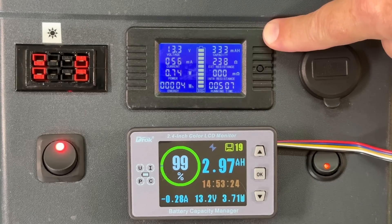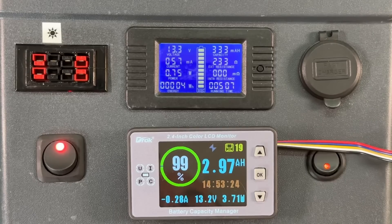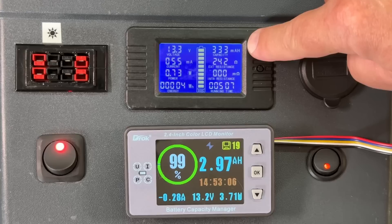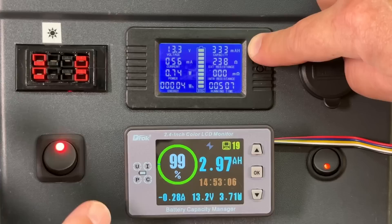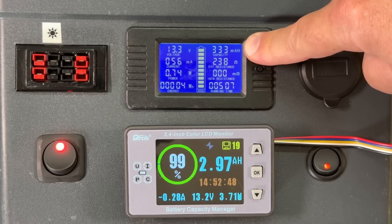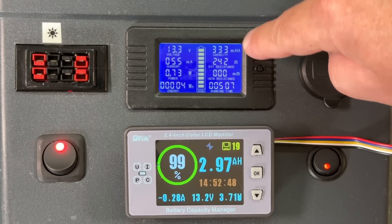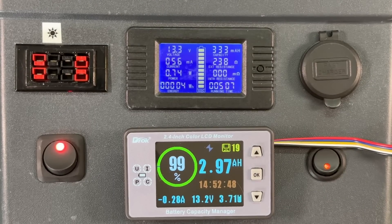For the longest time I've been using these meters to monitor what my battery is doing and they do a really good job, but this one does it better. These guys only count up, so if I'm pulling a load off the battery, there's a 12 amp hour battery in this box, so once this hits 12 amp hours I know it's dead. But if I charge it, it counts up as well. There's a solar charge controller in here, so if I have a load on it and I'm charging, this just keeps counting up so you never really know the state of charge of the battery.